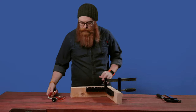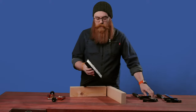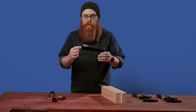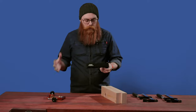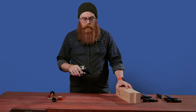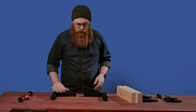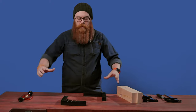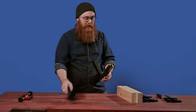There are a couple of interesting little features they don't even mention on the packaging. There are these little holes here — if you want to do repeatable jigs over and over again, like you make 15 drawers in a day for an apothecary cabinet or whatever, you can actually make yourself a little jig on the bench top that has the two inside corners of your unit in place, so everything stays in the same place. You clamp these corners together and it's all going to be square.